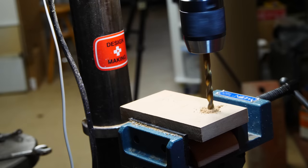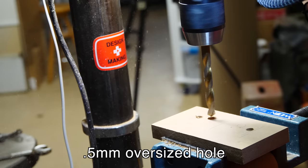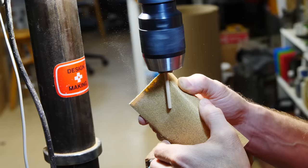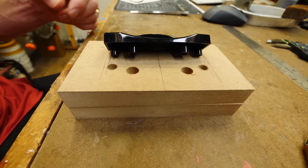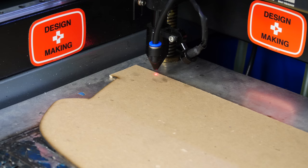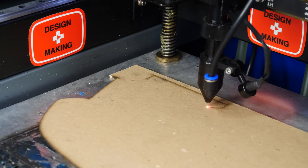Let's trace them so that we can drill out the holes on the drill press. Here I'm drilling an 8.5mm and a 10.5mm hole so that I can drop the chin rest into the perfect location on the base plates. Next I have to make some plugs that are going to plug the through holes on the chin rest so that the silicone cannot go all the way through the part when we cast the first side. Now I'm going to use the laser to cut some spacers that are going to go on the back side of the chin rest to give me some additional space for the injection sprue.